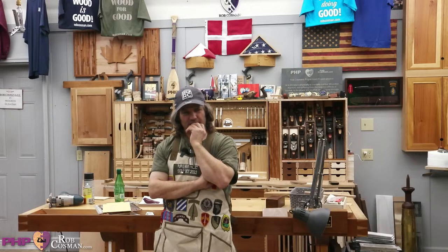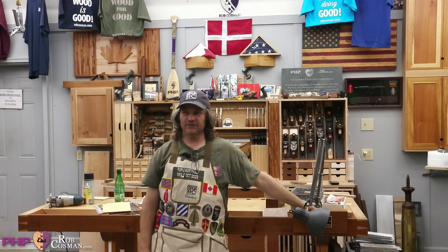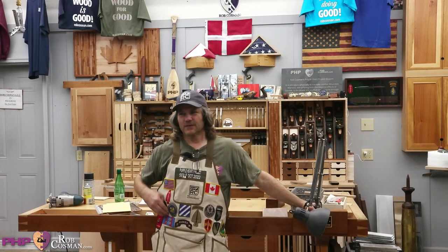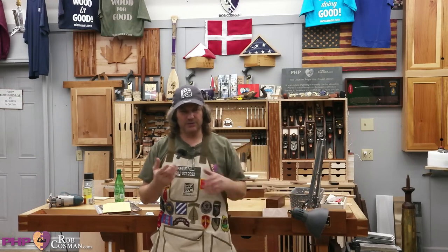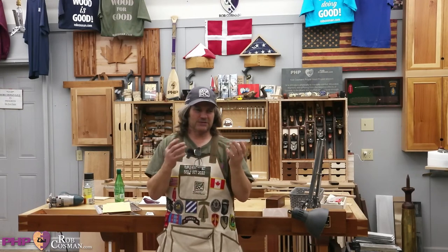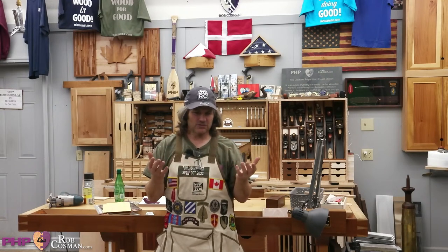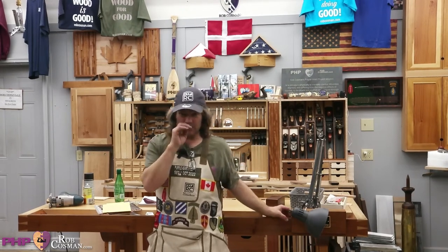Sorry, Mark. What are your thoughts on using kiln-dried lumber versus air-dried lumber in fine furniture making? Well, I actually have a lot of thoughts about that. I'll tell you a couple stories. I love air-dried because it works differently. Actually, there's several reasons. The color, air-dried wood has a much better color, deeper, richer color, particularly walnut. If you can imagine what I mean when I say work-hardened, when they kiln-dry it, it often does that. It changes the structure of the wood somehow, and I can only tell that through the feel of planing it. It just doesn't have the same quality.